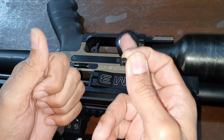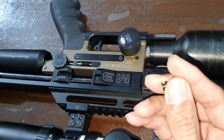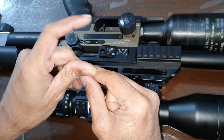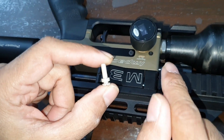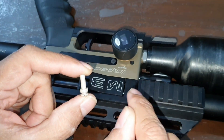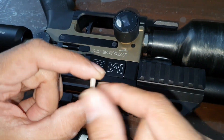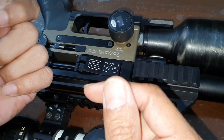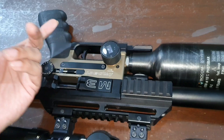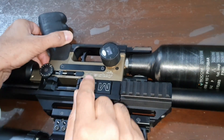Since we keep the pressure here at 150 to 180 bar, I used a PEEK material piston in this regulator. I polished the washers and made a PEEK piston. From the time I installed this piston, the first regulator became consistent — it went from fluctuating 10 to 12 bars down to staying stable.